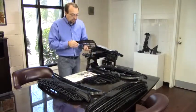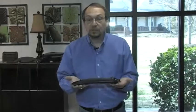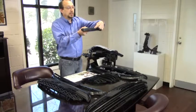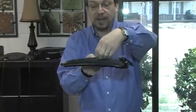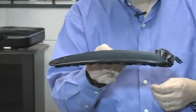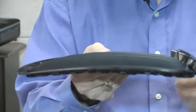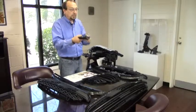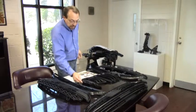Another condition that we see sometimes on grills is what we call drag marks. Drag marks are where there's a burr in the tool or the part texture is sticking in the tool, and when the mold ejects it actually scratches the part. You can see in this section on this part — it actually looks like a scratch, like somebody had taken something and scratched the part. That's a drag mark. That is also unacceptable on a grill. Anytime you see such defects, you should notify quality or your supervisor immediately.